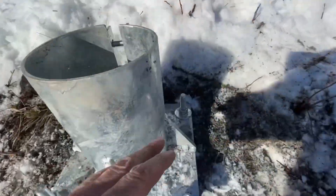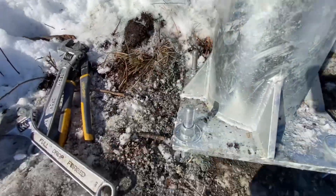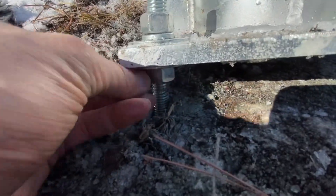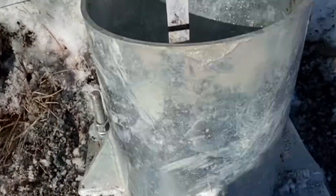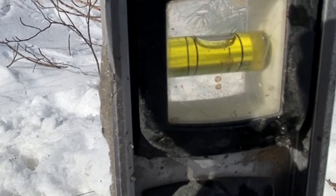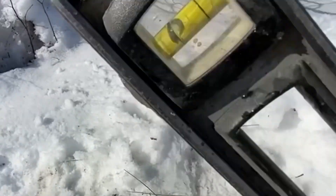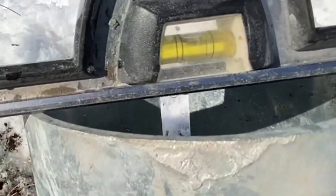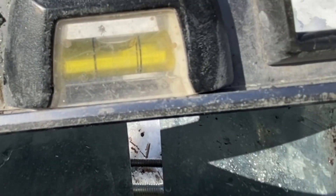With the flat washers and lock washers down, we can take our time and level it by tightening the top or bottom accordingly — that'll get different locations level. We can see that we get ourselves exactly where we need to be. Checking cross side-to-side, we can see that we have it level.